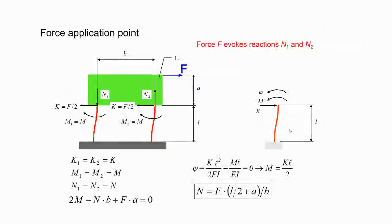Another point is when you are talking about the parallel guidance. If you just look at the geometry, you may feel that you can apply force in the compliant direction, and it will move. What's the big deal? But if you look at it closely, it can't be like that. You can't just apply that force F anywhere, whether here or here. So what should be the line of action?